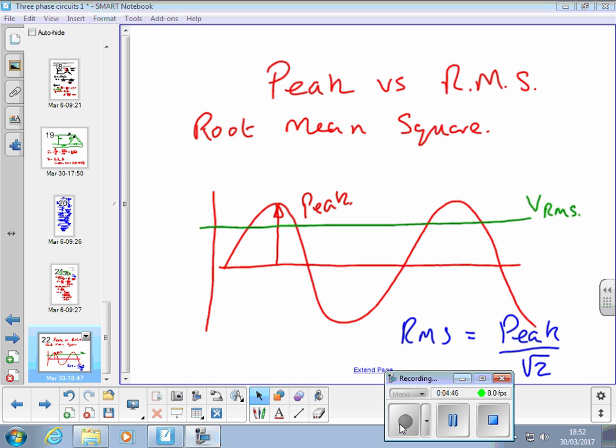But the other thing I don't like is auto ranging. I hate it. I like to pick my range. And I'll tell you why: if you're in low lightish situations where you're working in the back of a panel, it's easy to see spurious voltage spikes, 250 millivolts, microvolts, because it's on auto ranging. Whereas if you had it on 250 volts because you're expecting 230, then you put it on that tiny little voltage, you ain't going to see nothing. So I like to choose my range. The other thing is, if you're on the cusp between ranges, it keeps switching range, I just don't like that. I'm old-fashioned, I know, but select the proper range, know what you're looking for.